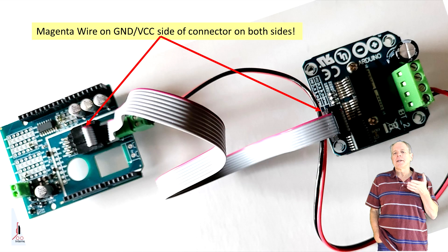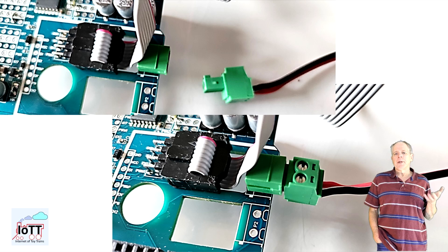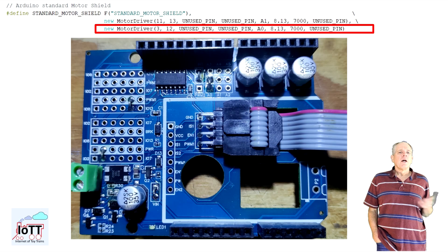Simply connect the 8-wire ribbon cable to the connector on the iBT2 module. From the track output of the module, you can run two wires back to the PowerShield using the green connector that comes with it. There are two reasons for this connection: first, it powers the LED so you can see if track power is on or off; and second, it also powers the terminal block on the other side of the PowerShield, which can be used to connect a programming track or the DCC input of a RedHat shield. Configuration of IO pins and definition in DCC X works the same way as shown for the internal version.